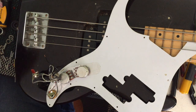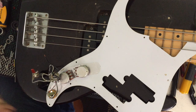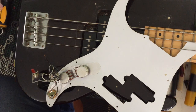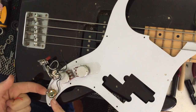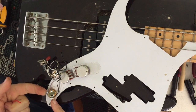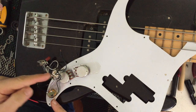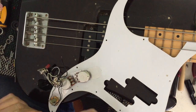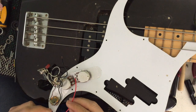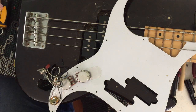I might keep some wire for the output jack signal to go to the middle lug. I'm going to replace this pink and gray wire that's going from the output jack — the hot end, the tip — into the middle lug of the volume pot. I'm going to make it go to the middle lug of the volume pot up here. This is a nice lengthy piece of wire. Let's connect it to the pot first.